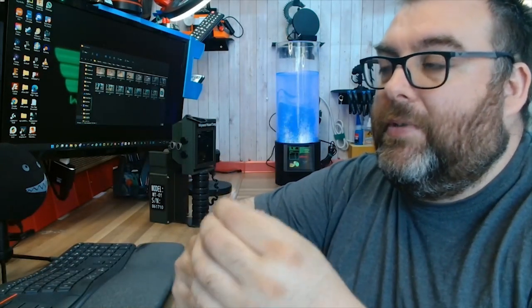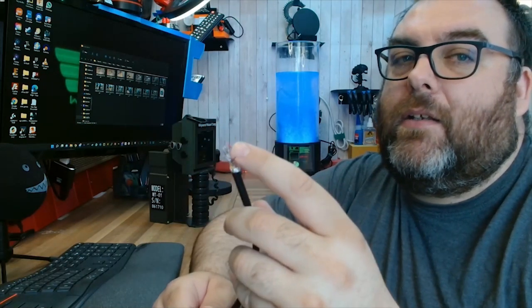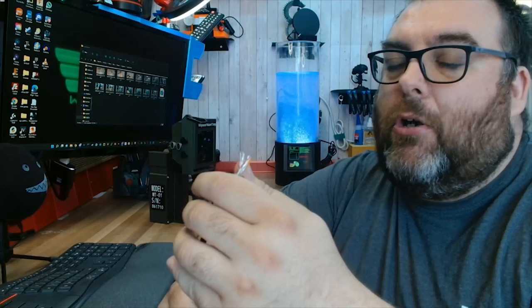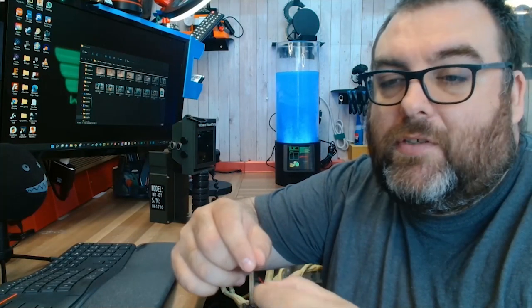What I wanted to warn you about is the individual strands of cable inside the HDMI lead. The cables I have have solid-core, really thin, colour-coded wires, and some of the colours are repeated within bundles. So you really don't want to unwrap every bundle at the start — you're better off taking each cable as it comes, soldering it, and then moving on to the next bundle, just so you don't accidentally solder the wrong cables together. Also, because these cables are so thin, when you're joining them and wrapping, say, red to red or orange to orange to prepare for soldering, they can actually snap — they're just so small they can't take much stress or strain. That happened to me a lot, so just be really careful.